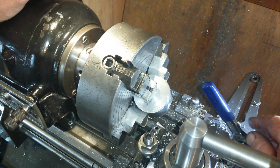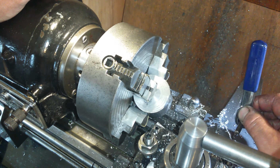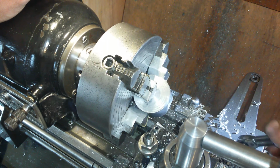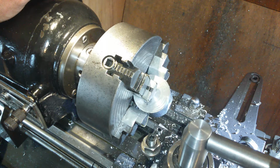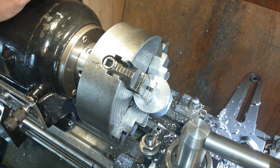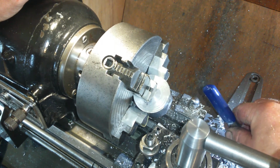Anyway, to do drilling, I will not need the lock for the carriage, but saying that, I can wind it back out now to 0, so bring it past 0 and then bring it back to 0, all the backlash taken out, set to 0, ready for my next cut.